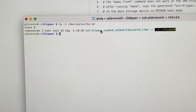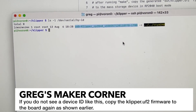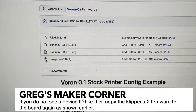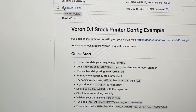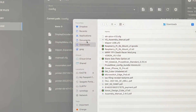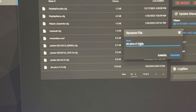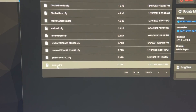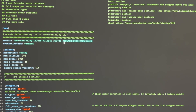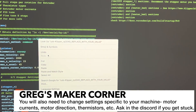Since I copied that pre-compiled firmware, I can go ahead and copy this device ID and use it in the printer.cfg that I'm building. I'm on the Voron site and I'm going to download the SKR Pico config file, then upload it to the Voron printer interface. I'll click upload file, take that downloaded file, and it says it's successfully uploaded. Now I need to rename it printer.cfg, and then I'll go in and paste in the value I got from that `ls` command — I've got it on my clipboard, so I'll highlight the placeholder, right-click, and paste.